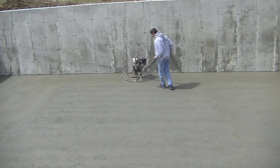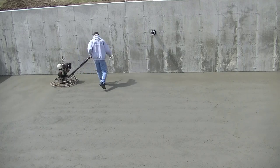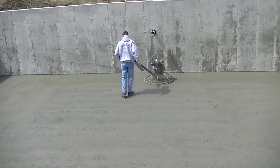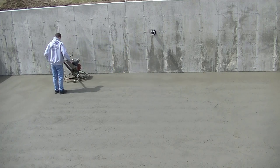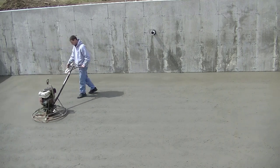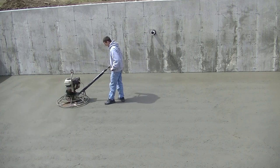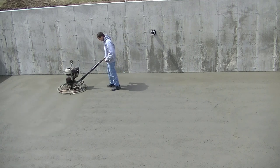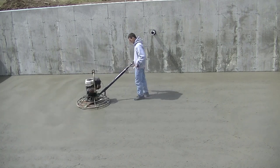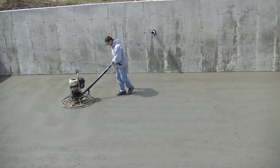I'm going to work in that sun area to get it down. What you're looking for is those finish blades filling in all the roughness from the previous pattern. As you can see once I get going, I'm going to cross and go 90 degrees from the first time we floated it — I'm not going to go in the same pattern every hit. If you did that you'd have a really wavy floor, so you cross your patterns, and that helps flatten the floor out even more.